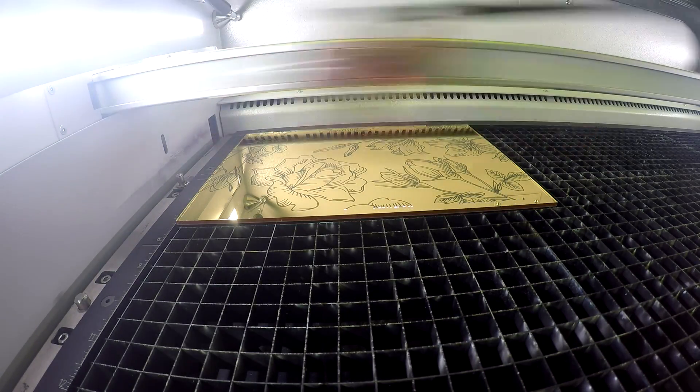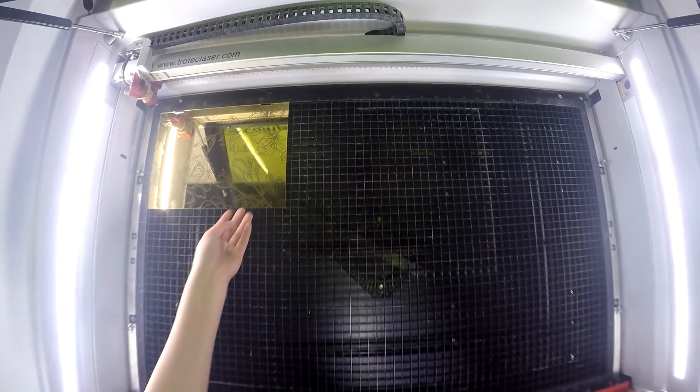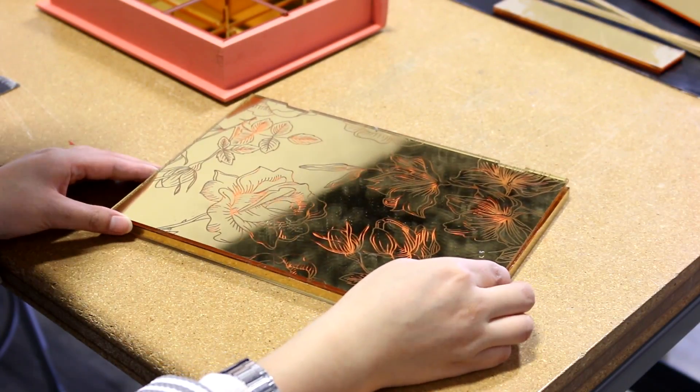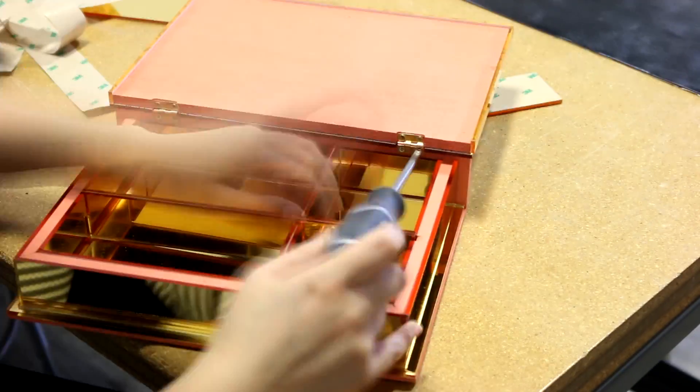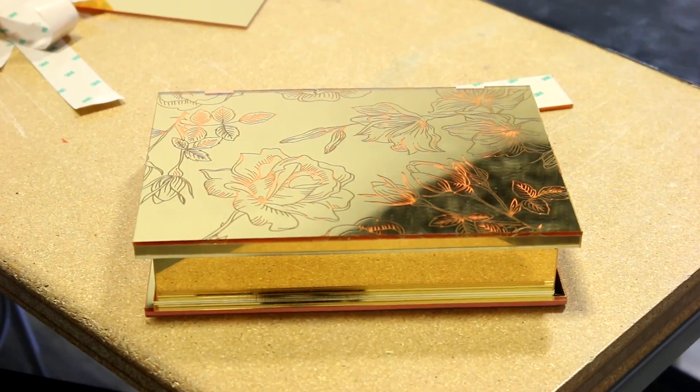Because of that effect, you'd be able to spray paint any color you'd like on the base and see it through the mirrored acrylic, but we've left ours clear in order that you can see the color of our spray painted box. Because we can't cut the acrylic with the fiber laser, you have to use the CO2. This is why it's so great to have a flex laser where you've got both laser sources built into one machine.